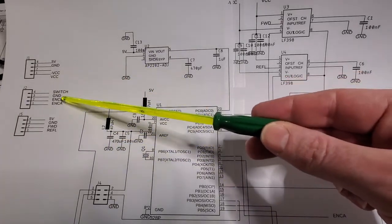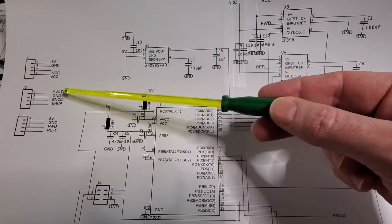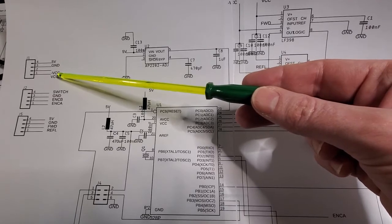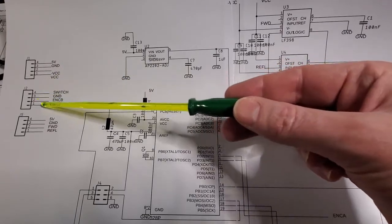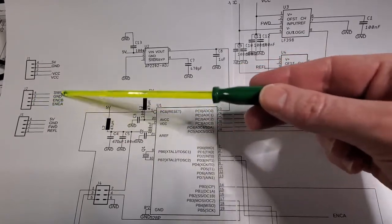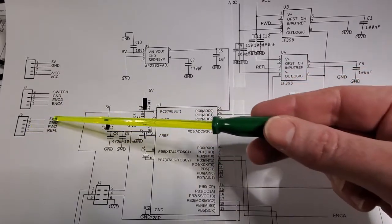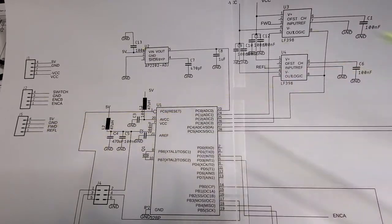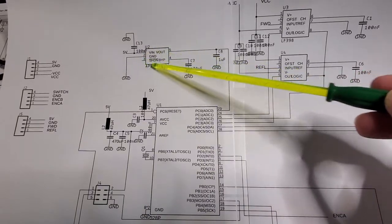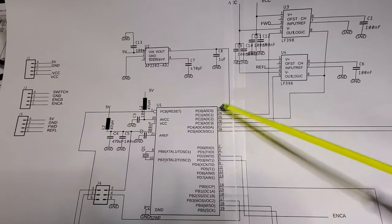And then I've got some pinouts here for off-board connections. This one is for the 5 volt ground and the plus or minus 12 volts. This one's for an external encoder, since I think I might need an encoder on this to just do some configuration. And then this is the connections for the 8307, the off-board stuff. So anyway, this is where I'm headed. As I said, next step is I've got this on the proto board. Going to connect this up to this ADC pin here, and then we're going to read the result.